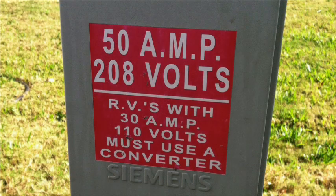You can take that 208 volts and turn it into 120 volt power for your 30 amp supply, or 240 volt for your 50 amp supply. When 208 Y power comes into your park, it'll come in as three hot wires plus the neutral. If you measure from one hot wire to neutral, it will be 120 volts, but if you take one hot wire to the second hot wire, it'll measure 208 volts.